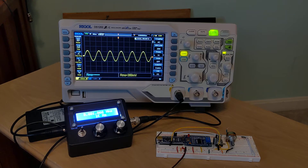You can see the breadboard on the right — the Nano, the DDS module, a digital encoder for changing the frequency, and a potentiometer for attenuation, plus a display. Those are the whole project. On the left is the finished project, powered by 12 volts and hooked up to the scope.